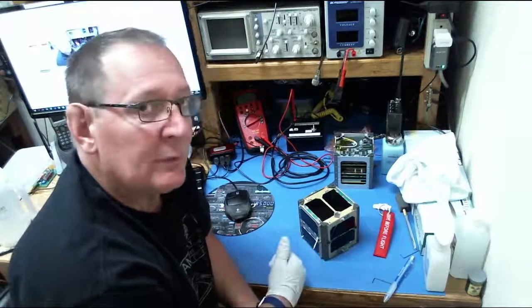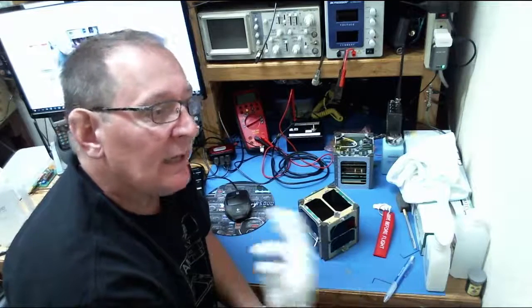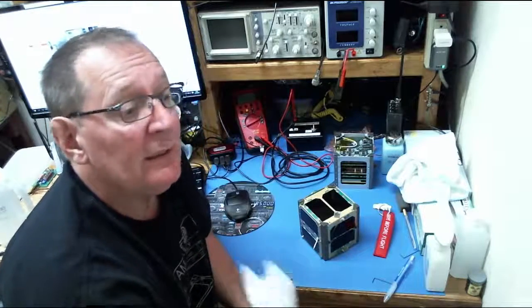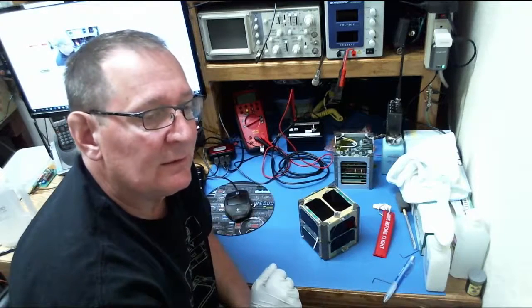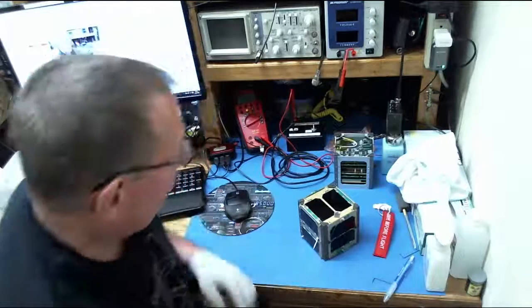At that point, you'll be able to see the antennas deploy because we'll pull the RBF pin, time how long it takes, and then actually, once we've achieved the 45 minutes, we know that we satisfy the launch provider and they're actually happy, but we let it burn the whole 50 couple minutes until the antennas deploy so that we're satisfied that our deployment mechanism is working our way as well, and our software.